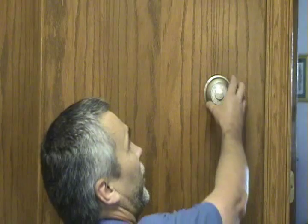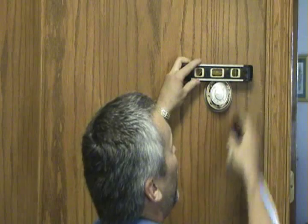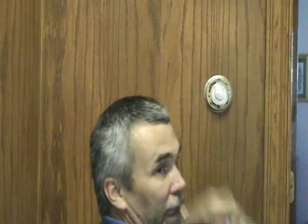The next part of your air conditioner maintenance is checking your thermostat, especially if you have an older mechanical type. Begin by shutting the power off to your furnace and air conditioner. Remove the face plate by pulling on it. With a small level, place it on top of the pegs on the thermostat and read the level — make sure it's perfectly level. If it's not, it will throw off the temperature it comes on and off, and it will cost you quite a bit of money.